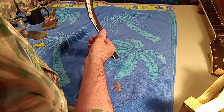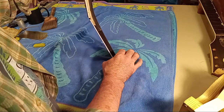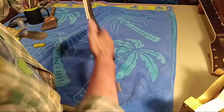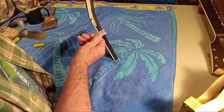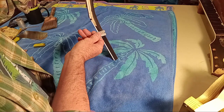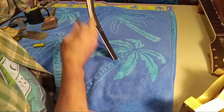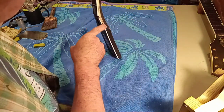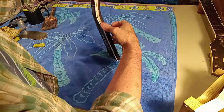This is a jazz guitar. And if you don't know what I mean by calling this a jazz guitar, this is 5/8 of an inch thick right here, and this is 9/16 of an inch thick down here. It transitions from the thickness of the neck into the headstock. So by just natural woodworking, it's a little bit thicker right here. And the cool thing about it, they don't just have this on a 90 degree angle with the front of the headstock. It's pitched on a 90 degree angle with the plane of the fretboard and the plane of the neck. So you've got to make the decision, well, do I come in here and scrape the back edge of this off so I don't have that fingernail catching, or do I allow the paint to build up in there?